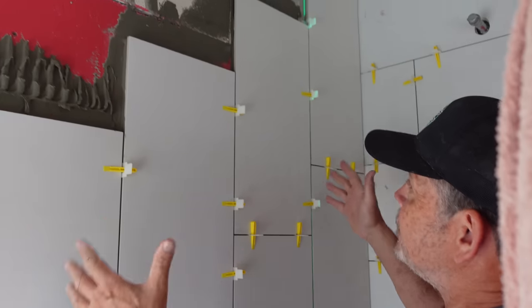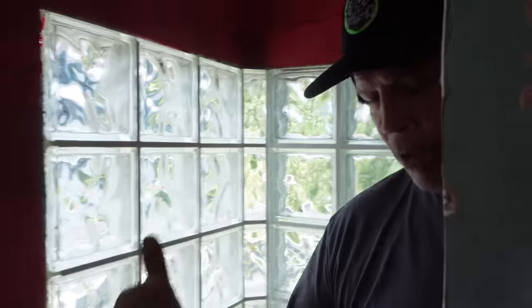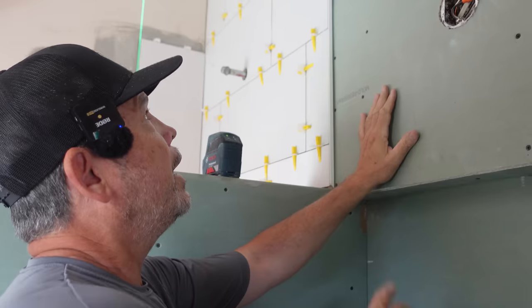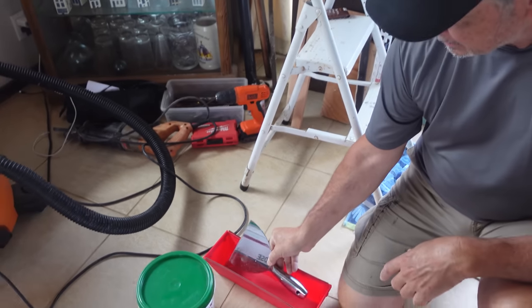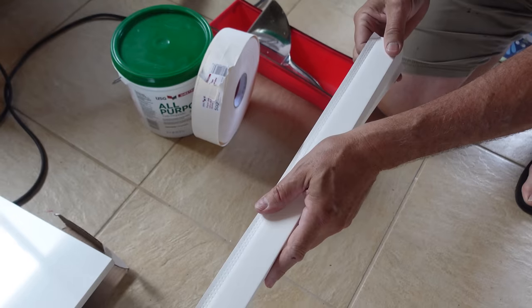It is the next morning — check it out. This is how much tile we were able to put up last night. It's coming out awesome. I'm going to put Jordan and Rad on tiling so they can work together in there, and while they're doing that I'm going to hit the drywall because we've got to start thinking about paint. For drywall tools: ran to the local Home Depot, bought a cheap plastic mud pan, spent a little extra on a stainless steel knife — well worth it, it'll last forever. Got the smallest bucket of all-purpose mud we could find and the biggest roll of tape they had. Also picked up some plastic mud-on corner bead — I didn't want metal because it's going to rust here. Looks like we have a full day's work ahead.